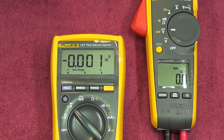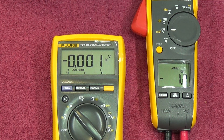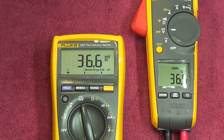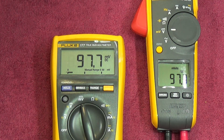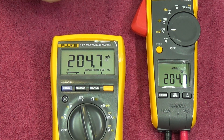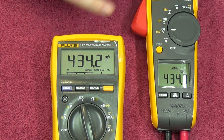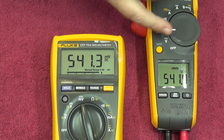With both meters hooked up to my DC reference, this meter won't do microvolts or fancy things — just standard millivolts. We're showing 1.2 mV on the reference and 1 mV here — pretty much on par. At around 97 mV we've got 97.8 on both. At 204 mV the reference reads 204.7 and the Fluke 376 reads 204.7 — still in range. At 433 mV on the reference we're showing 434.2 and 434.3. At 541 mV we're showing 541.3 and 541.4. So far so good on millivolts — quite impressed.